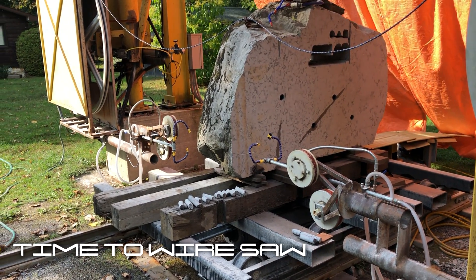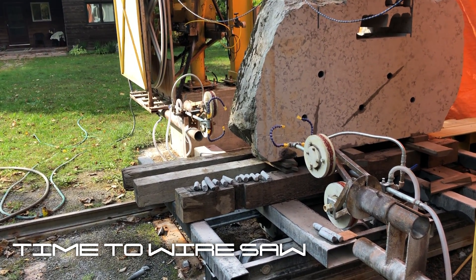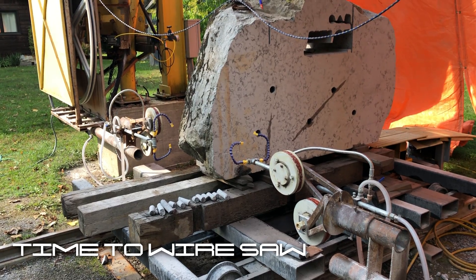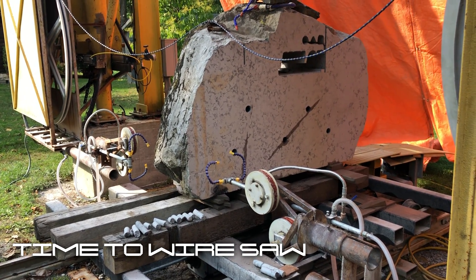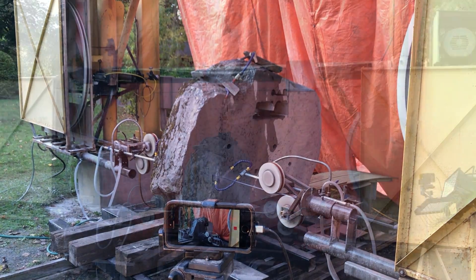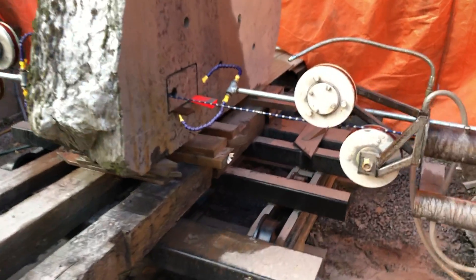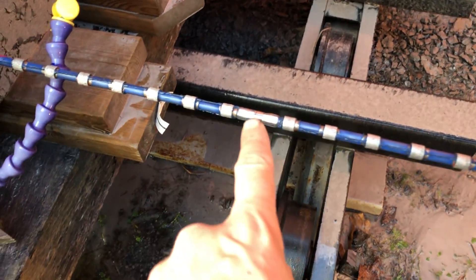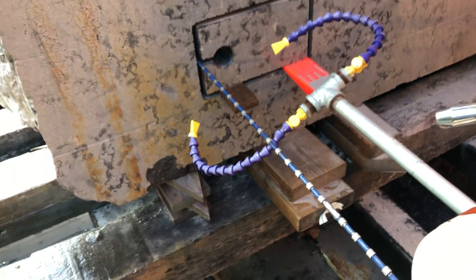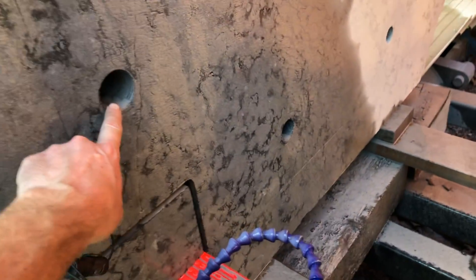It's set up now to cut with the wire. I'm at the origin and will load the other program, which will do a tool change and then move to the center of the first hole. I'll bring it back when I'm feeding the wire through. Let's just finish the first rectangle — that's where I break the wire. I just have to let the tension off the wire first, then feed it back and it'll move to the next hole.